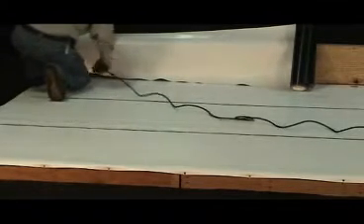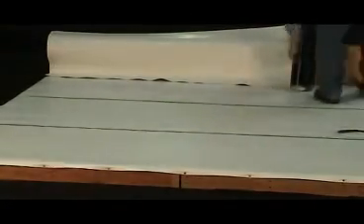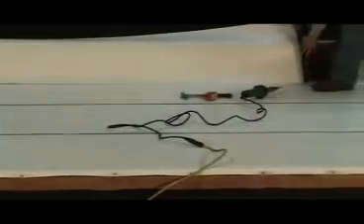Wall sheets can be set firmly in place by simply using a handheld heat gun and placing it underneath the seam to create a tack weld. Move down approximately 5 inches and repeat.